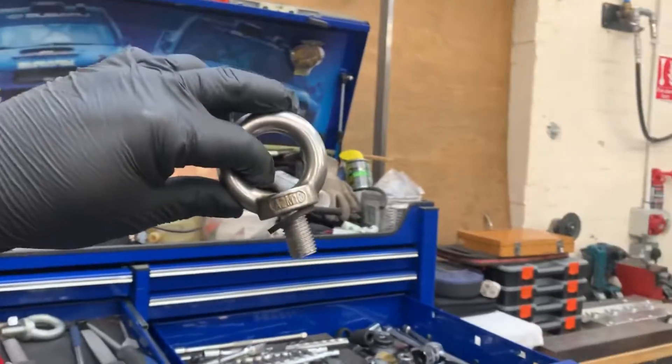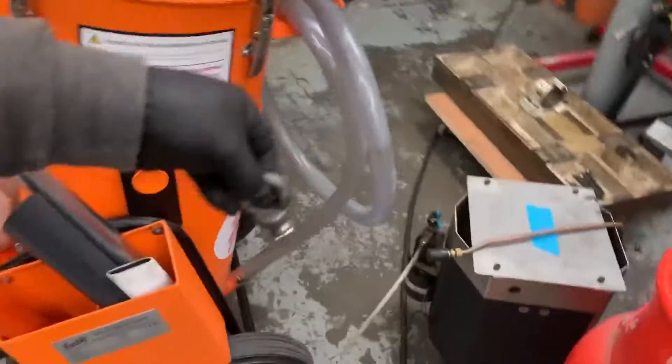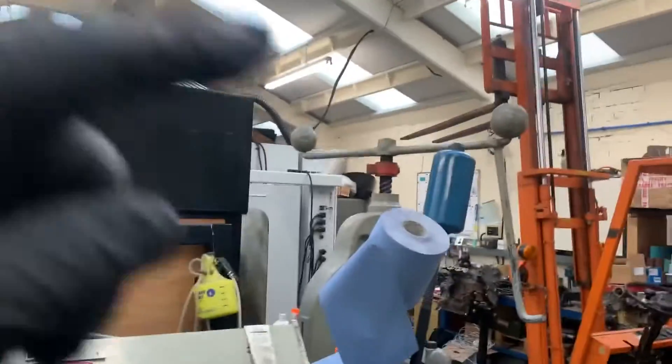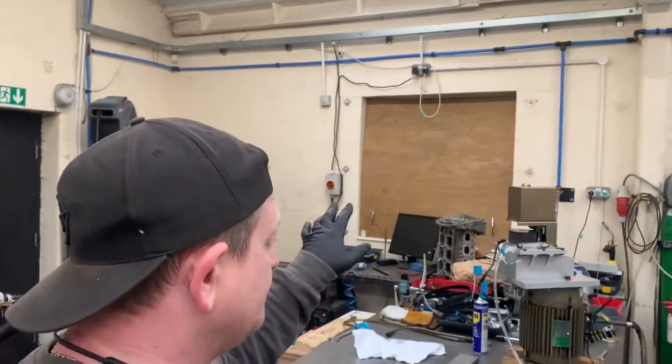My other option is I may do something with the top plate to allow me to use a lifting eye - I've got a few lifting eyes that I could potentially put on. That one's got a nut, I could put that straight through that plate - it could probably go straight in there and allow me to lift it with a much shorter strap or a little chain section. We need to lift it high enough to clear all this, and if you remember when I took the motor off and it wouldn't clear the arm for the pendant, Gary was in the forklift and I swung it over to one side and tilted it up. So I'm going to get all that put back together, get it ready for lifting, and at whatever point I'm ready to lift it I'll do a quick video - probably speed it up as a time lapse showing the reinstallation. Thanks for watching, see you again soon.